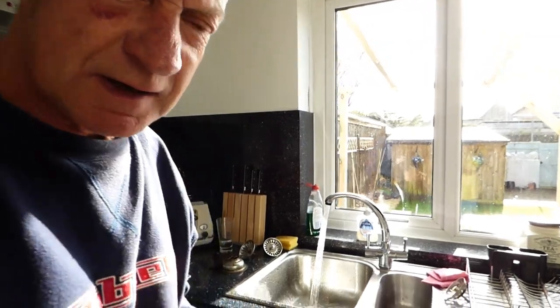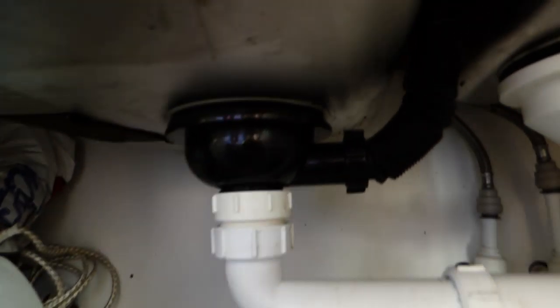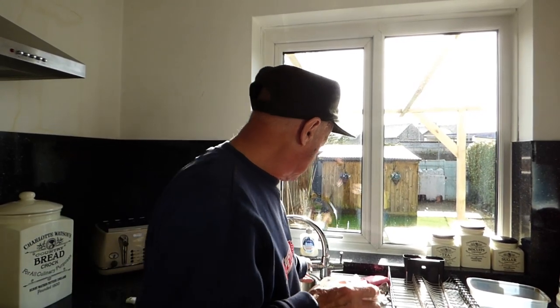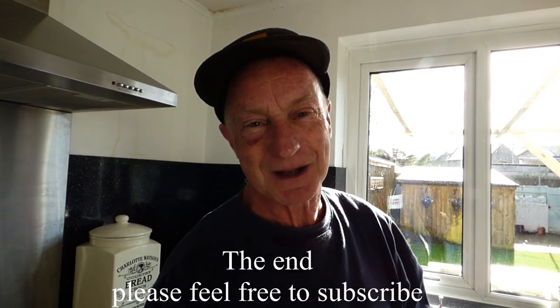There we have it - that's the job done. All we have to do is do a test - run a bit of water. You can put a sink of water if you want or just let it run, check it's not dripping, and the new fit certainly is good. Now there are some different sizes - this is a larger waste, but basically it's still the same job. Whatever you find you've got - the small one or the larger one - it's still the same thing with a screw through and doing it up, just different sizes. Hope that's helped some of you out there. Thanks for watching guys, bye.